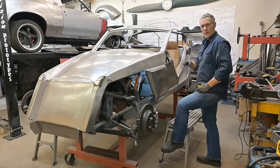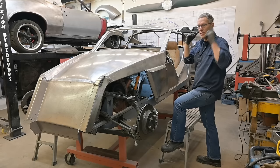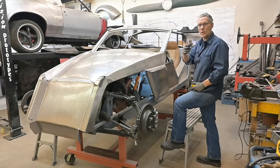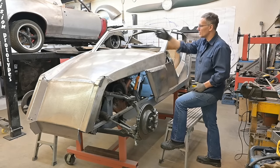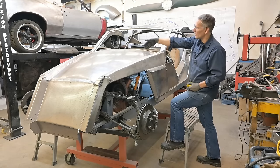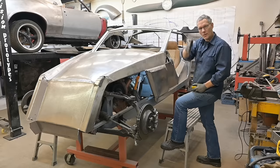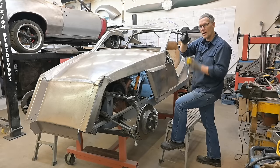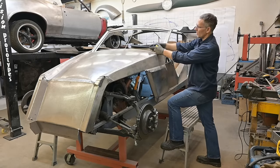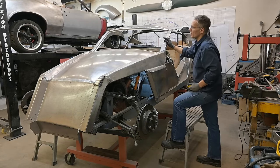Yep. Now you might be saying, whoa, Nick, I can't hear you, but you might be thinking that, and through ESP you might be coming in and watching this after it's been done, but you might be saying, you're putting the flange over here. What about this back edge that you're so concerned about? Well, we have to come up with the web, come back with a flange, and into that flange tie a piece of sheet metal in that'll pick up the back edge of this hood so that we have some strength there. It doesn't flop around.